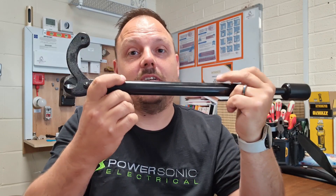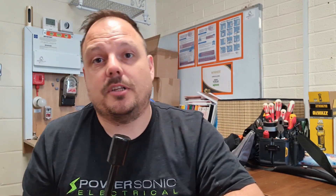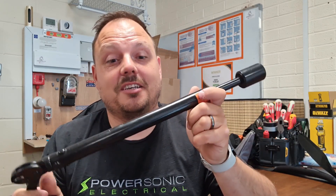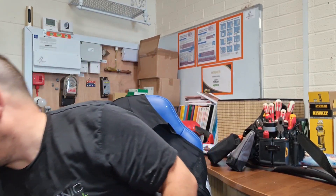It does leave a mark in the top of the floorboard, so if it's someone's finished floor they want as a finished surface you might not want to use this. But on a typical rewire where you need to get nails out, it's a brilliant easy way. We gave it a try a couple of months ago — all the nails out straight away. Usually you cut your tongue and grooves, lift the bar, then have to de-nail everything with a hammer. Going along with this first was like an absolute treat. About £30, and I got it off Amazon via a link David kindly sent.